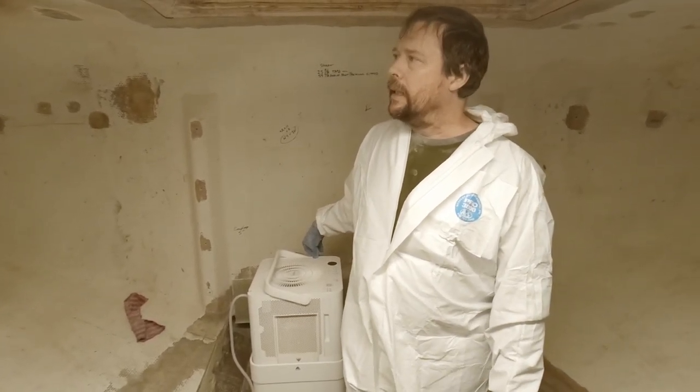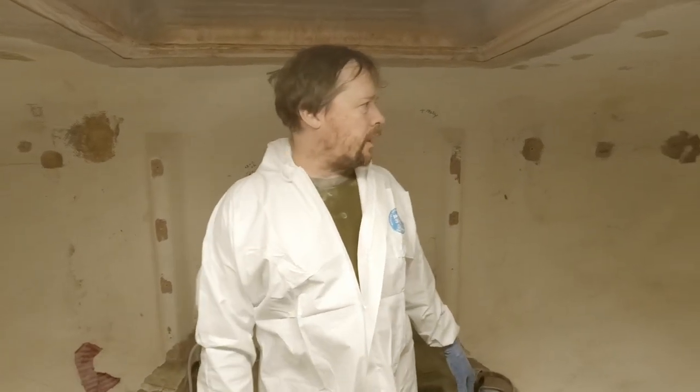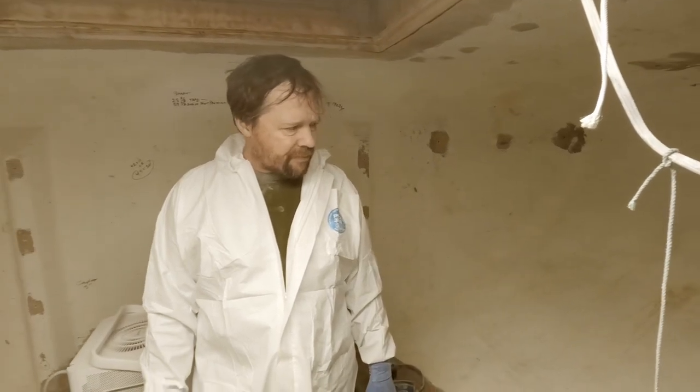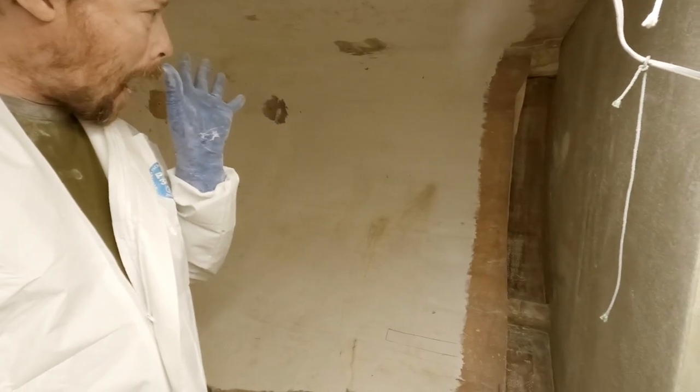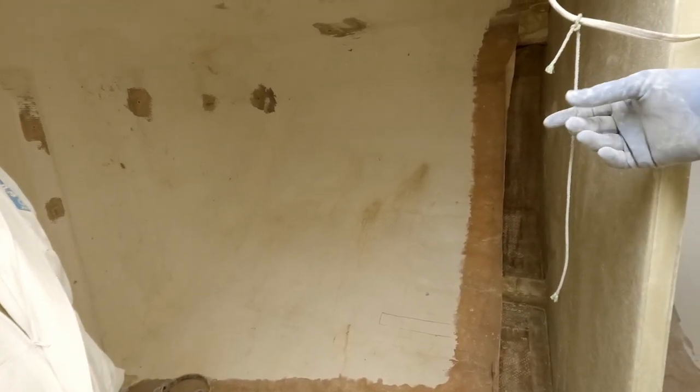We're probably gonna start tabbing this tomorrow. It's all prepped. The surfaces are all ground down good, roughed up. Yeah, we'll just wipe it down with some acetone first when we get going, and that'll pull any remaining moisture off the surface if there is any.